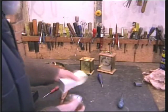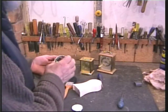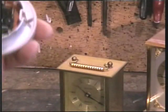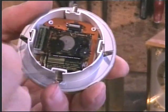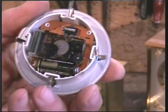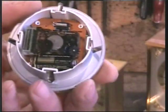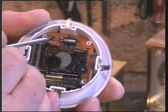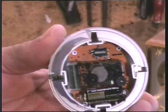Here is a cheapo clock — this is an ideal candidate. With a little screwdriver, let's go in. All quartz clocks are governed by a little quartz crystal, and just here is the quartz crystal. You will find them on all the movements — they might be on the other side of the printed circuit board. But they will all be a little cylinder like that with two wires sticking out the end. That is the quartz crystal that governs the timekeeping of this little movement.